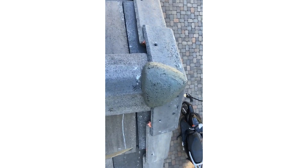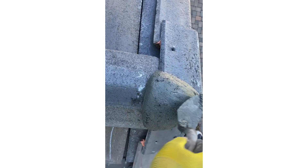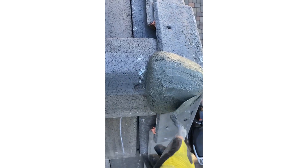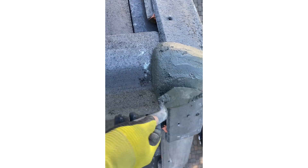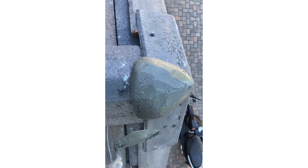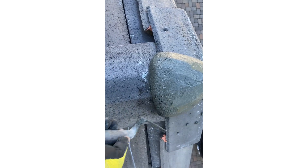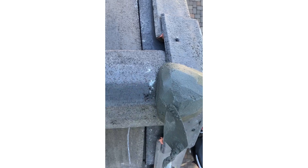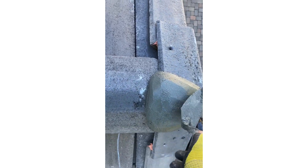When you do your mortar caps, make sure you put a little bit of water on top of the mortar and then try to make it smooth so it looks nice. This is how I do it — I try to leave it as neat as possible, making it look cosmetically good.